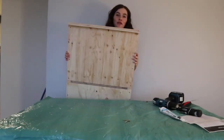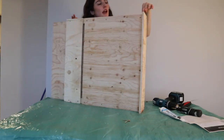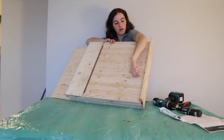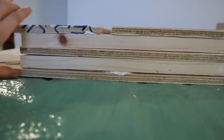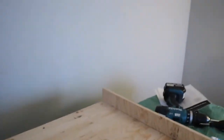Now we have our box with the roof on it. The next step is to go through the sides — any gaps I see along wherever two pieces of wood came together, I'm going to apply a thin layer of caulking to ensure it's airtight and water won't seep in. I'll fill in any holes or gaps between the boards, and do the same for the roof with a thin layer along the edges. Then I'll let it dry and apply the stain.